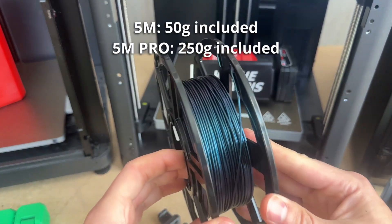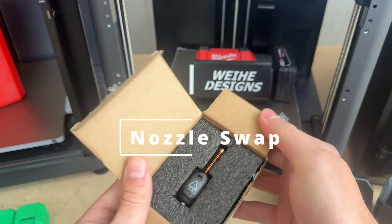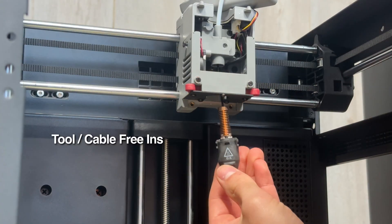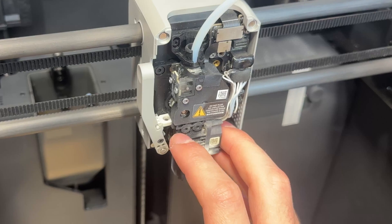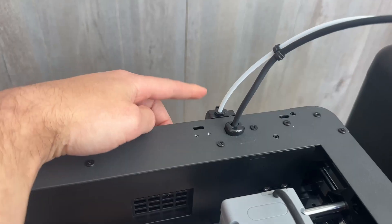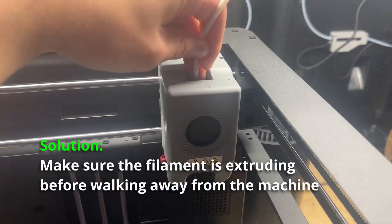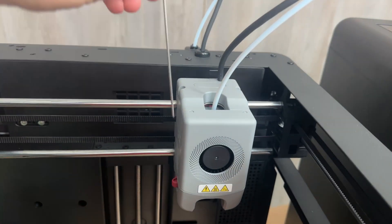The filament included with these printers is called Burnt Titanium. Normally I print exclusively in black PETG, so it was pretty fun using a different filament for a few tests. The next thing I did was switch out the nozzles on two of the three printers to a 0.6mm. You can get them as separate add-ons, but with the 5M Pro they actually include a 0.4 and 0.6 in the box, and installing the nozzles is really simple. The tool-free release with the red levers makes swapping nozzles much faster than on a Bambu, which requires dealing with two screws and two to three cables. There's a filament sensor on the back, which is good, but you have to make sure the filament actually gets pulled through the PTFE tube into the extruder. I forgot to check once, so after a few hours, the only thing on the plate were the remnants of the filament in the nozzle. The provided toolkit includes some nice essentials like snips, allen keys, a nozzle declogging tool, liquid glue, and some grease.